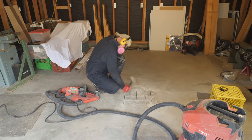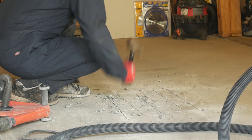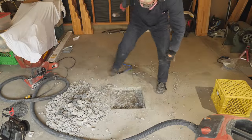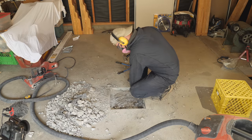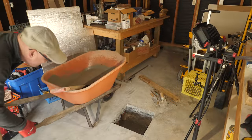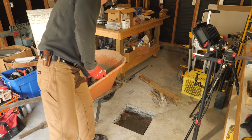The well for our house is very close to where I'd be cutting, so I didn't want to use a wet saw and have the runoff contaminating our drinking water. I wasn't too concerned about a bit of dust, so renting the dry concrete saw just made more sense. I made cuts around the perimeter then a few cuts in the middle, then I could break up these pieces with a hammer. After I cleared the square of concrete I cut back the plastic and dug down about a foot deep. Cutting concrete with a saw is strangely satisfying — next time I'd cut around an inch deeper so breaking the pieces would have been easier.